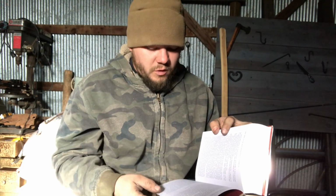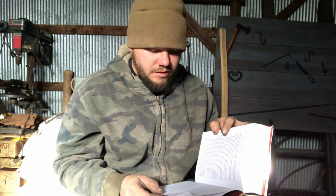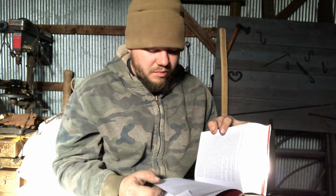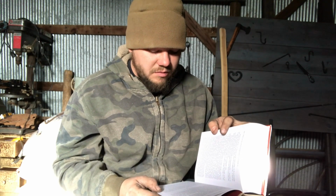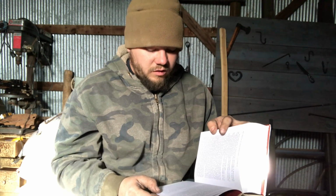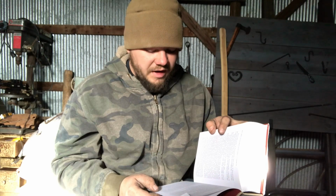Case hardening plan 2. One of the prime requirements in case hardening is that the article shall be well polished. If the iron is not quite sound or shows ash holes, it is hammered over and polished again. The finer the polish which is imparted to the surface, the better the results will be in case hardening. The articles are next embedded in coarse charcoal powder in a wrought iron box, which should be airtight.